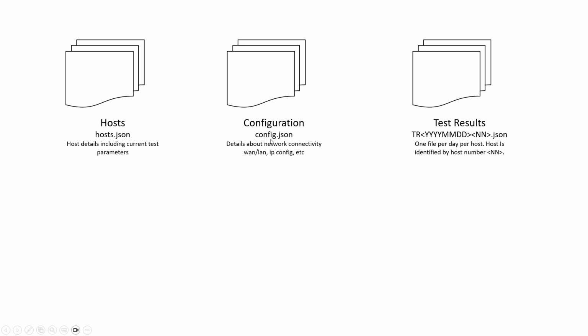Like I said, I think I'll also have a config.json file. It'll have information about whether I'm using the WAN or the Wi-Fi interface for network connectivity, passwords for the Wi-Fi if we're using that, and the IP that I want the device to start with. So I'll just give it a static IP address, but I can specify it in the config file.